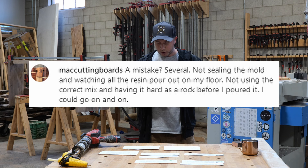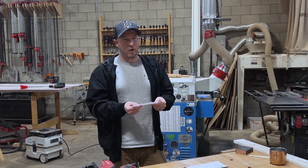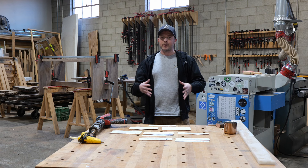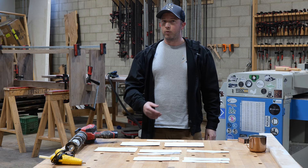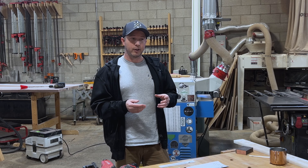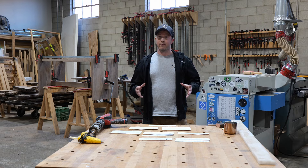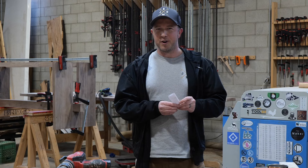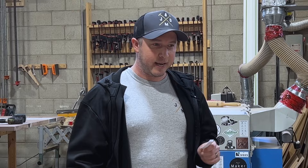Mac Cutting Boards made several mistakes including not using the correct mix — having it hard as a rock before pouring. Always double-check your two-to-one or one-to-one ratio; the brand you're using may have a different ratio. We use a scale, or you can use volume containers. Think of it as a scientific mixture — if you're off by more than five percent, it's either not going to cure or will cure too fast and too hard, resulting in a failed project. Having a scale or containers on hand is super valuable. We've all made the same mistakes — good habits and double-checking eliminate them.